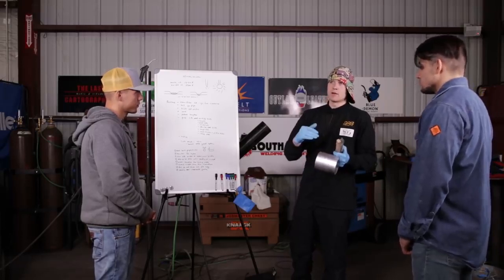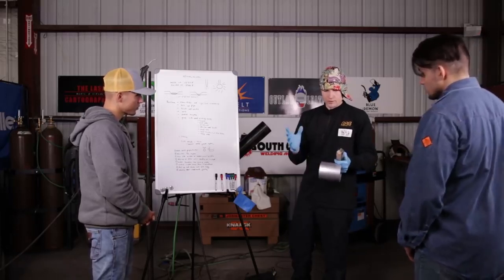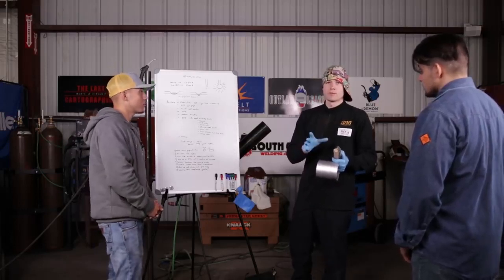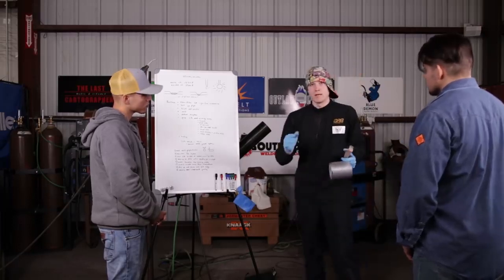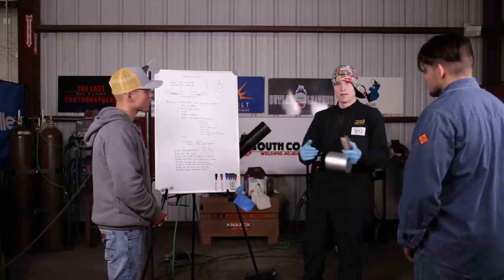it doesn't matter relatively what machine, you can still do the welding as long as it's AC. For frequency, I'll be running probably about 120 to 160 hertz, and a balance of maybe about 65, which is the balance of the positive and the negative. On the Miller Dynasty 350, we can independently change the electrode positive side and the negative side, which is the cleaning action and the welding action. We can also change different waveforms in the secret menu. You just hit the amperage button and the dig button, and I can change through all the settings and the waveforms. I believe there's a sine wave, triangular wave, advanced square wave, and soft square wave.